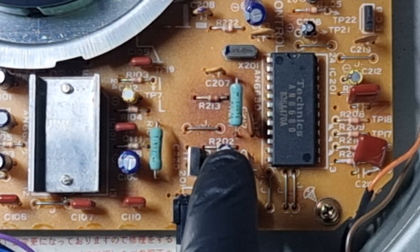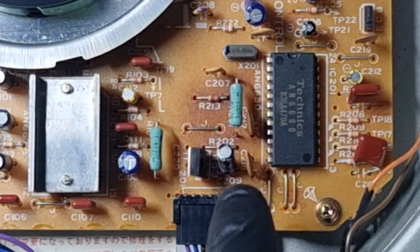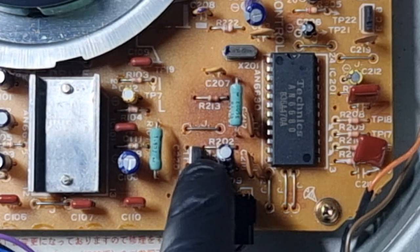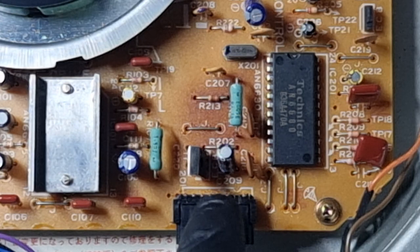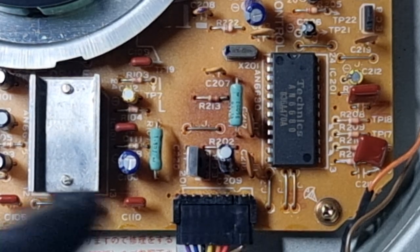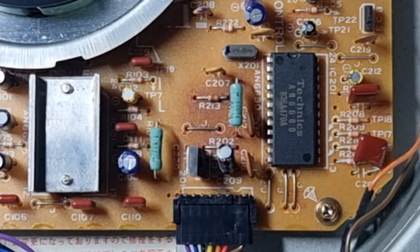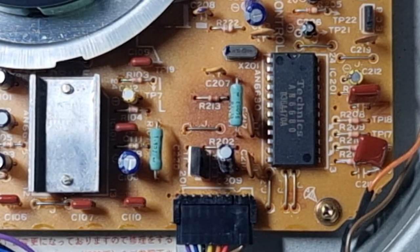It's going to be a heat-related issue, so I'm going to need to change it. I mean, this component's being changed anyway. I'll have to check all the rest of these on here as well. But on this occasion, it's pretty apparent that this is causing the issue. So if you've got a break in the board, i.e. cracked solder, you can have your speakers on one minute, the vibration's going through your desk, it's vibrating the turntable, and it doesn't take much to move it back to hit the connection and off the connection again. That's why these are intermittent.